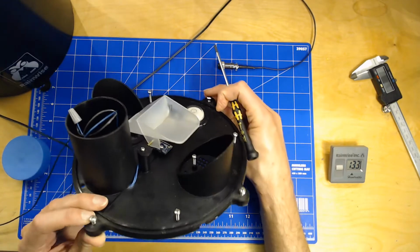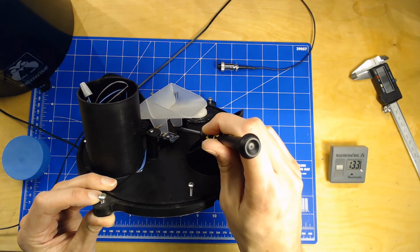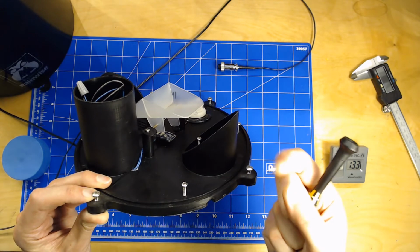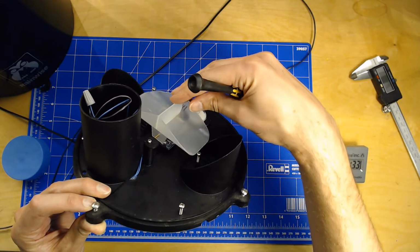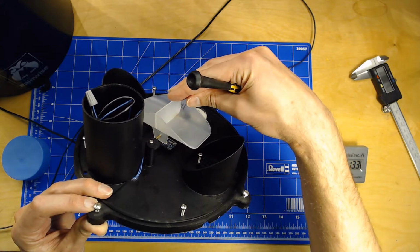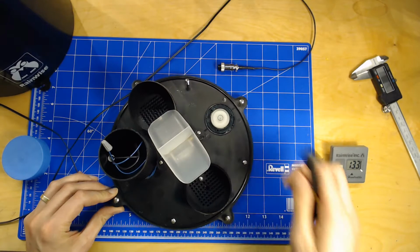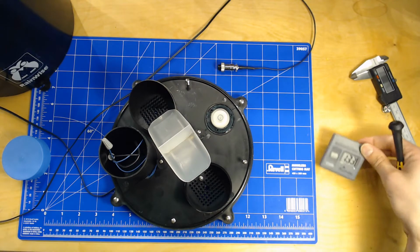It's a really simple construction, these rain gauges. It's a reed switch that as soon as it comes close to this magnet, it closes like a switch, and then as soon as it passes it, it releases again. So you can almost hear a tick when you pass it here. There's a small tick, tick, and that's how it works. And then you use the microprocessor to calculate that.